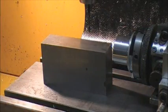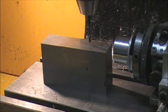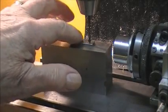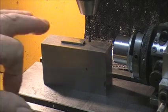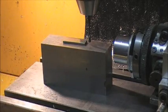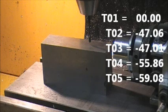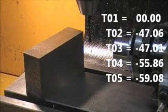As a check, if you wish, you can bring that back to your zero tool. So the Z axis is now set at zero and the gauge block should just fit — it passes under. Come down one hundredth and there we are — that's just to confirm we're still set correctly at the reference. I'm still set at the centre of the axis here for the job so I'm going to raise it.